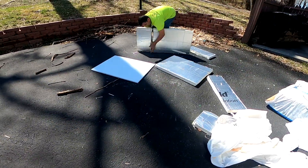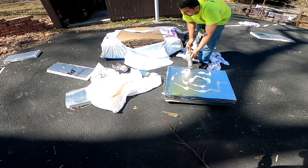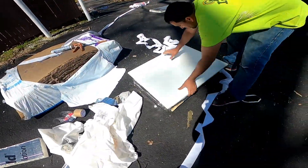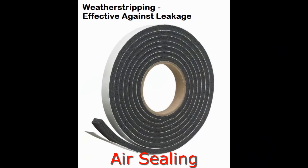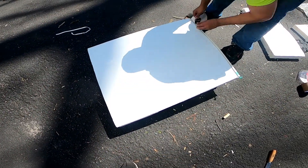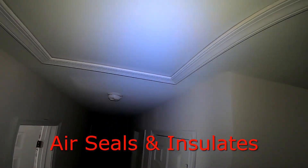You can see what Ivan is doing here — he's taking the rigid foam board, measuring this particular house's hatch, cutting the pieces, taping them together, and affixing them to the original panel. When weather stripping is applied and it's placed back into the ceiling, it creates a better seal. The weight of that insulation and weather stripping makes it more airtight and insulates better.